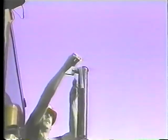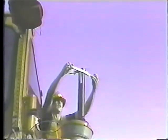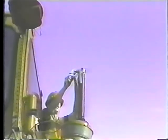If the piece of equipment you're towing has a turbocharger, tape down the rain cap on the exhaust stack. That keeps air from rushing in and damaging the turbocharger. But be careful. The exhaust stack may still be hot.